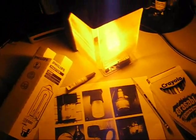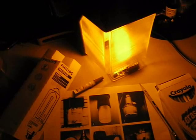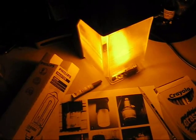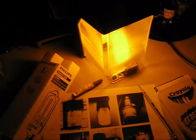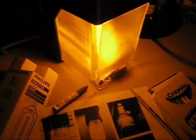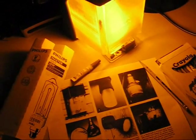Even though they didn't make it big in the U.S., there are some areas nearby here in California — mainly North San Diego County, the city of Temecula, and in Riverside County the city of Hemet and nearby areas. Since they're so close to the Palomar Observatory, they use low-pressure sodium lamps in their street lights, since astronomers can easily filter out the monochromatic single wavelength. So that's one advantage for the astronomers.